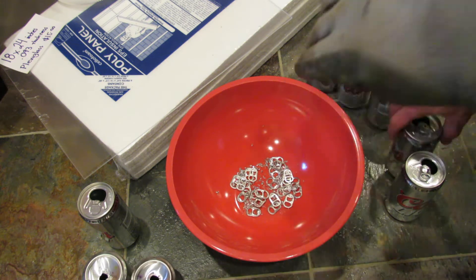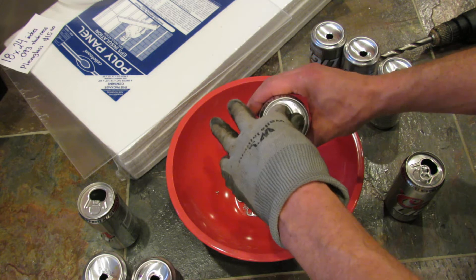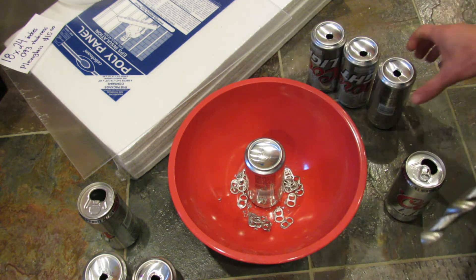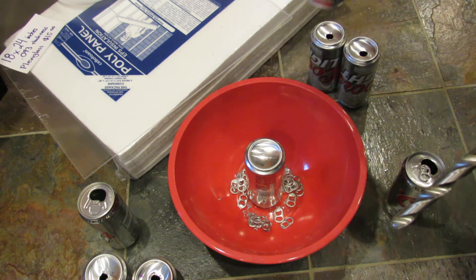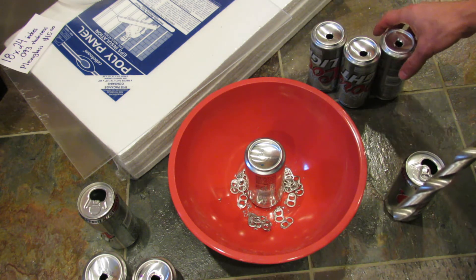To prepare the can, you just pull the tab off, push the flap into the can, and I'm using a thick drill bit — I'm only going to put one hole in it. It will look like this. Some people say to cut out the entire bottom, which creates more airflow, but I don't think I'm going to need it at this scale — an 18 by 24 inch solar heater. If it was bigger, maybe I would use it.